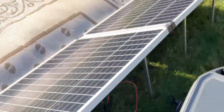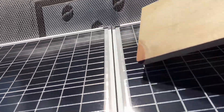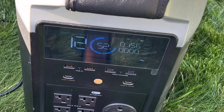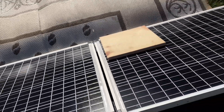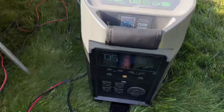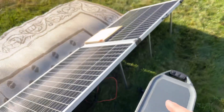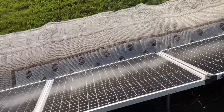I'll take off one of the blocks. Still 160 watts — nothing has changed. Series-parallel means those two panels are not affected. Now, what happens if I put this block in the center? We have two panels in the center that are open, but those two are in series and so are the other two — and the result is zero output. Because in a series-parallel connection it takes out the panels it's connected to, so they cancel each other out.